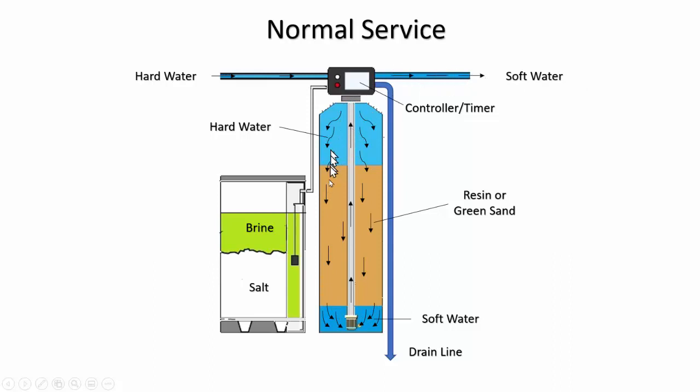When you purchase a water softener, you're purchasing the ability for it to soften or remove a certain amount of hardness. Once it has used up all of the sodium in the resin, it is time to regenerate — to get this ready again to make more soft water.